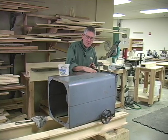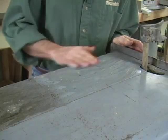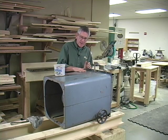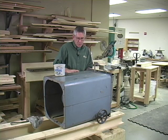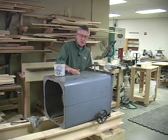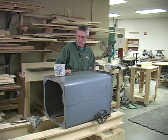Wet sanding this metal is much like what you'd do if you were wet sanding a finish. If you haven't tried that yet, it can produce spectacular results. Even though the finish paint will have a smoother feel than it did probably when it came from the factory, what I'm really doing is taking away a lot of the dirt that's built up over the 65 years this saw's been around. If you're worried about sanding through the paint, you can substitute 600-grit sandpaper for this 400. It won't cut quite as fast and it might take a little longer, but you'll get the same result.